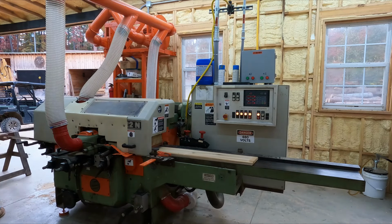All that pressure shoe is for is when that board comes off that head gear, and this head hits it, if you don't have that pressure shoe in there, it'll chatter. And it doesn't have to mash it down, it just needs to hold it. So when it goes across that cutter, before it gets to this roller, it can't sit there and chatter. And it was a little tight.